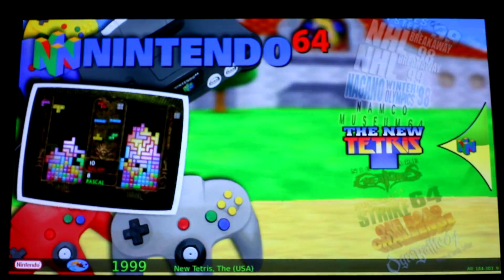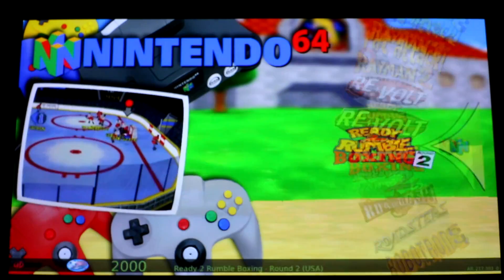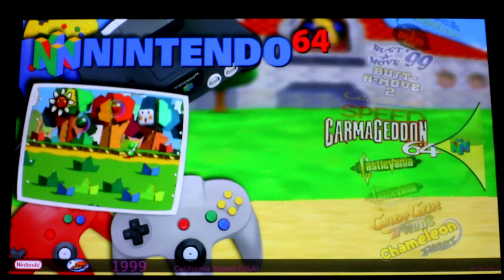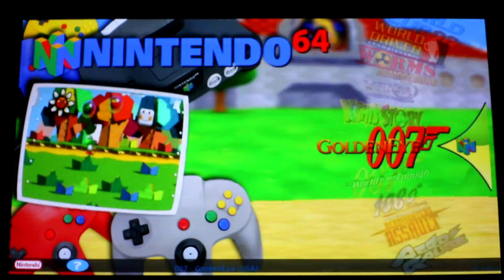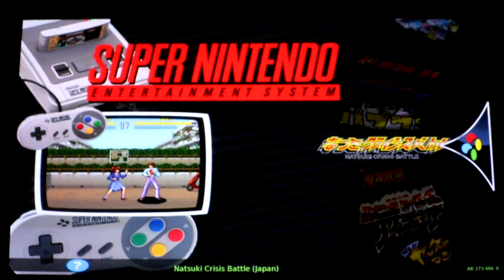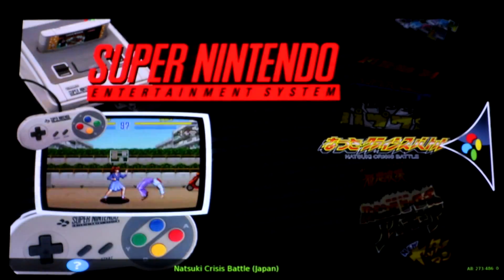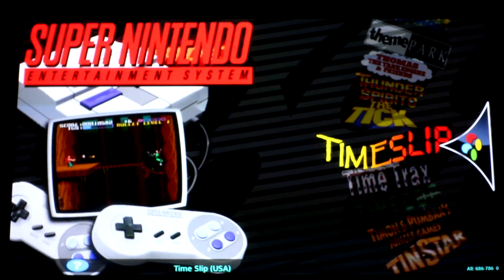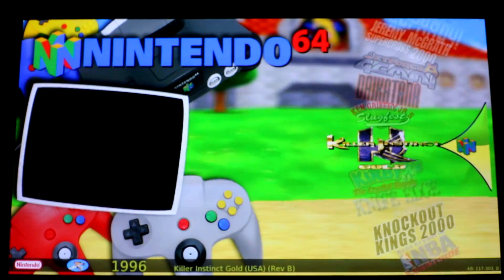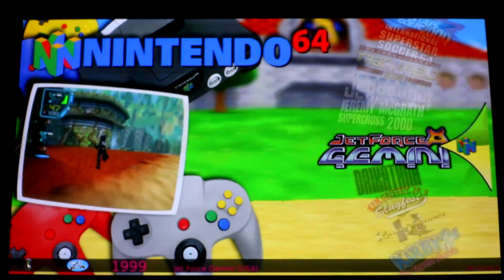The other thing with overclocking is I've had it happen a couple times where I'm scrolling through this menu and it freezes. If you overclock too much, scrolling through the main menu causes a freeze — that's actually a really good way to test whether you overclocked too much or not. Just hold down the down button, and if constant movement around the menu causes your Pi to freeze, you're too overclocked — take it back a notch. Not all overclock are created equal; some Pi's clock better than others. Now at 1.3 it's super stable, but at 1.35 it's just not stable. If you like this video please like and subscribe and we'll see you guys next time.